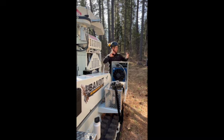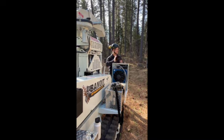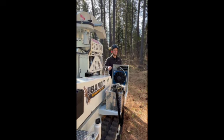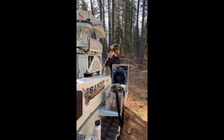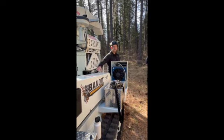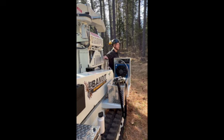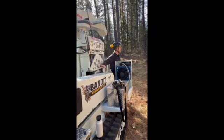When you slowly put that handle in, you bump it in, you're allowing it to press, pick up some speed behind it, get some inertia. Once it's matched at 800 RPMs, that's when you put that handle down, you throttle up so everything runs together at 2200 RPMs, and then start your chipping process. If you're ever engaging this clutch, you smell something burning, you hear something slapping, you hear squealing, you see smoke coming out of there, please stop the machine immediately and find out what's going on.